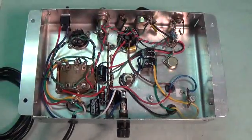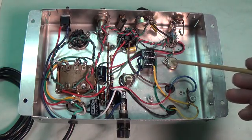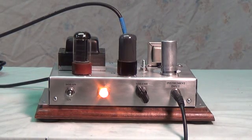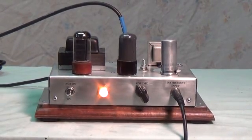Well, that about does it for the circuit features of this little chassis. Let's flip it over, plug it in, and see how it sounds — and also let's see how the adjustable negative feedback loop affects the tone of the amp. We're plugged in, the power switch is flipped from not-on to on, and as you can see from the pilot light, everything's working — no smoke yet. Volume is at less than one half and the negative feedback loop is at about 22K, which is the original setting. And I'm playing through the infamous Natco 12-inch workshop speaker.